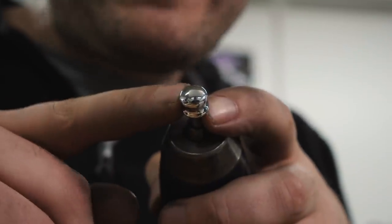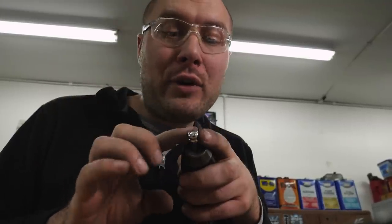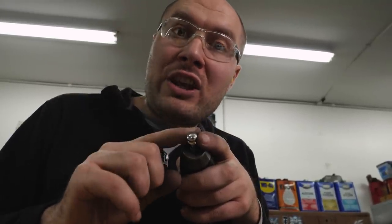This little guy should be ready to go for the bluing. The Damascus this frog is made out of is pure nickel and 1084. I'm not gonna etch it at all. I'm trying something brand new for me. I've never done this before, and I'm gonna just gun blue it, and the pure nickel should stay perfectly bright and everything else will turn jet black, shiny. So it's gonna be really, really pretty if it all works out well.